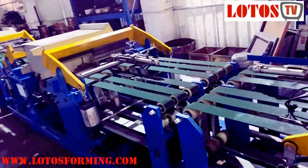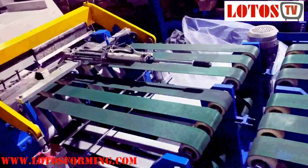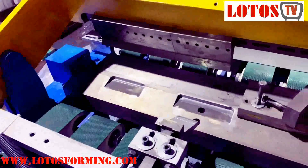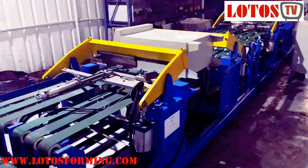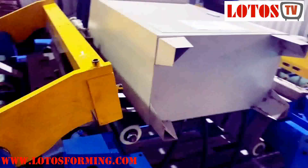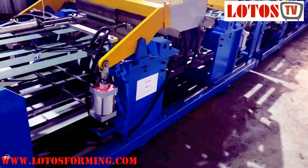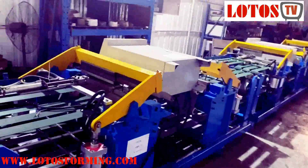This is the output. The folding dial can fix the box board and it can be adjusted according to different box board widths. It's already dispatched to the loading container. We need two sets of the folding system. On this unit we can do the folding and overturning because we have two ends — one is front and one is in the back — so we need the overturning system together with the folding system.